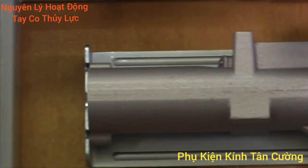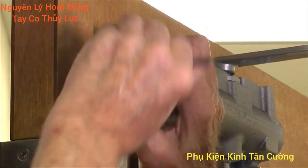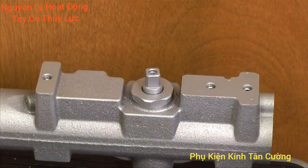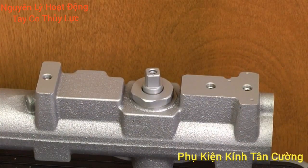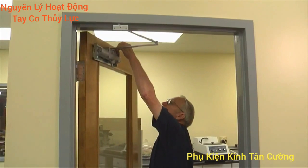The spring adjust screw may be adjusted to obtain the appropriate closing force, and to accommodate for varied door sizes and latching hardware. Our cast iron closers have easily accessible valves for adjusting back check, sweep, and latch speed functions.